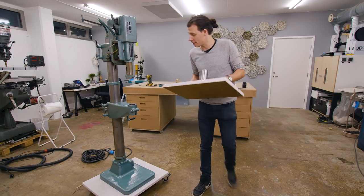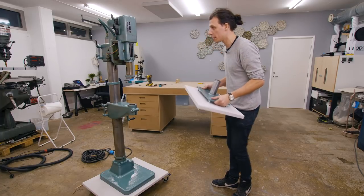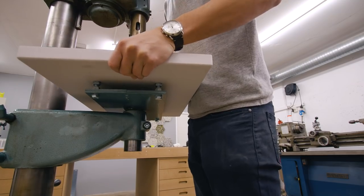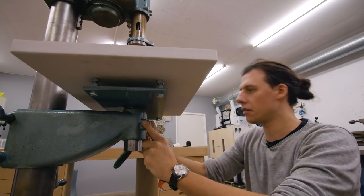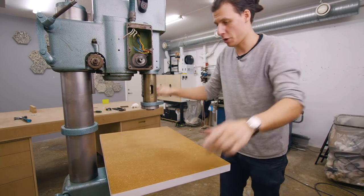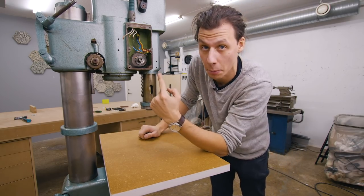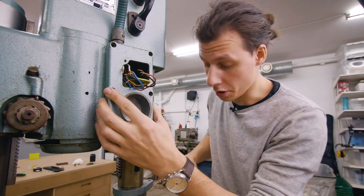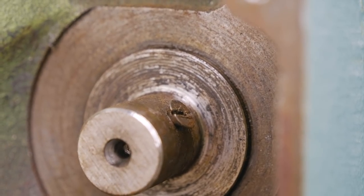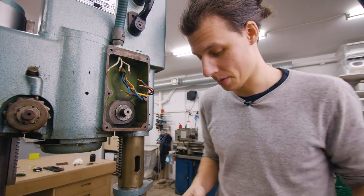It's been about a day and a half since we painted - the color I mixed up takes quite a long time to dry. It's dry enough now; I've assembled the table and also put the entire drill press on this rolling stand. Now it's time to mount the table for good, tighten this down so that everything is secured, and then we'll level it once everything else is done. Now that we have a nice big and sturdy table, it's time to deal with this thing that doesn't want to return up. There's a whole bunch of parts missing from in there - there's supposed to be a spring that hooks onto a little nubbin on the inside, gets wound up in there, and makes sure that it returns.